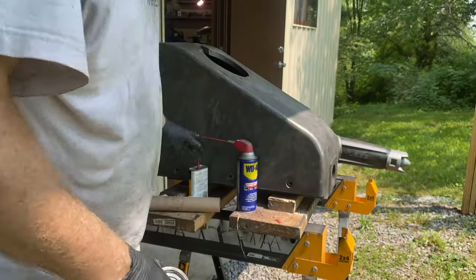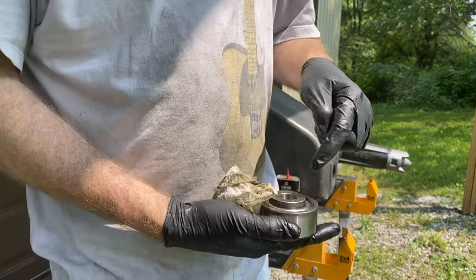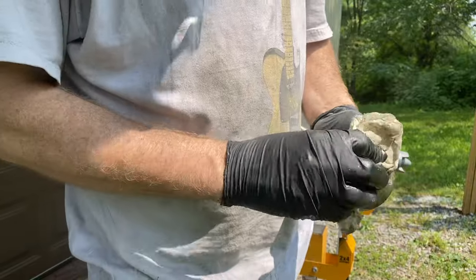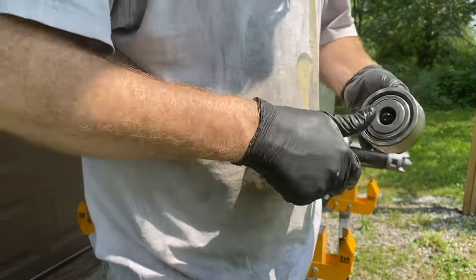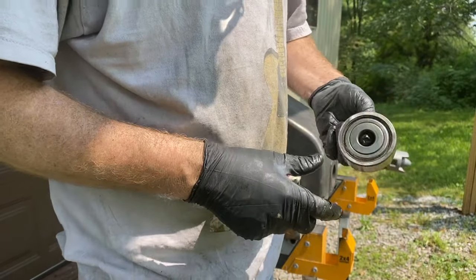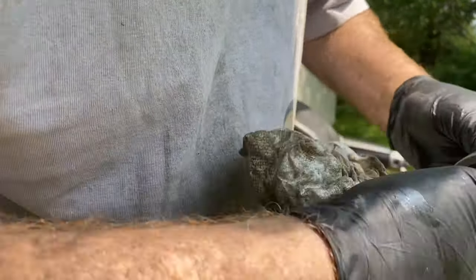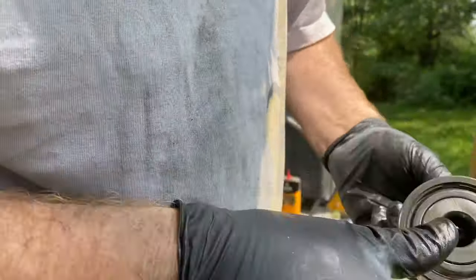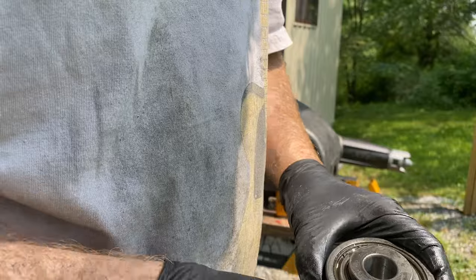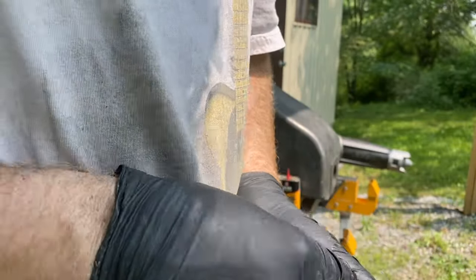And then I put in some penetrating oil. And the oil that I put in here very rapidly came out this side, so it's not a sealed bearing. And then I put some spindle oil from my lathe, and I've spun it. There's a little bit of roughness, but as little as this thing gets used, that it just is a thrust bearing for going up and down on the knee, I'm gonna look into the cost, but if it's more than like 20, 30 bucks, I think I'm just gonna stick with what I've got.